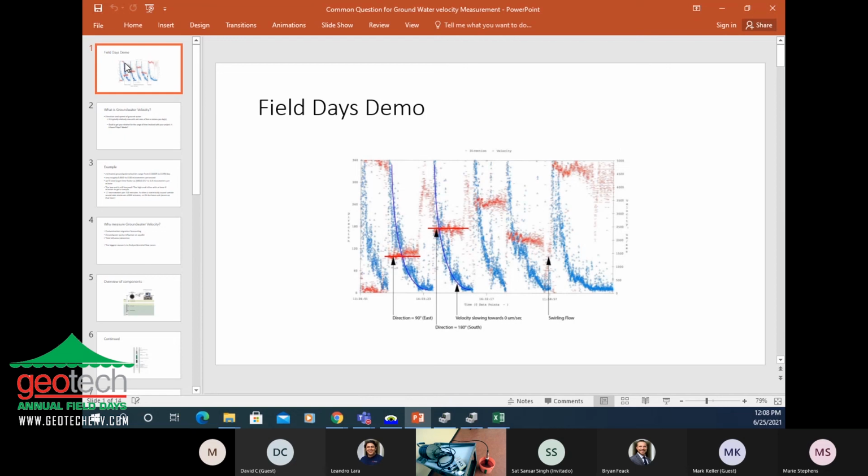John, any applications where this would be super useful? Well, like you said, as far as the plume, being pretty accurate about a recovery well or a monitoring well. Those are expensive to put in. That's good to know. If your plume's traveling 1 foot per day, and you have 60 days until you can put in the well, you better be 60 feet further than you thought you were going to be.